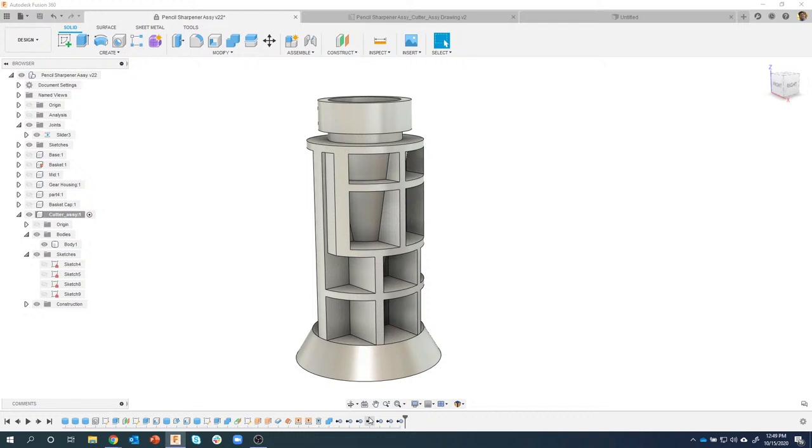Okay. If I had said delete, I could have potentially gotten a lot of downstream errors because stuff that was referencing those surfaces, like these guys here, if you delete it, they have nothing to reference anymore and they go, hey, I don't know what to do. So removing says, I just don't want them in my design, but I still can reference them. So like I said, 99% of the time, you're probably going to use remove.